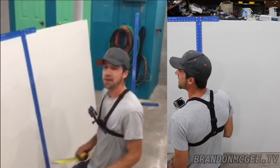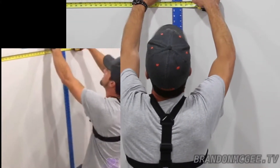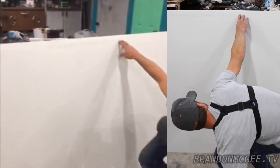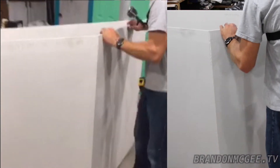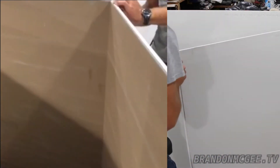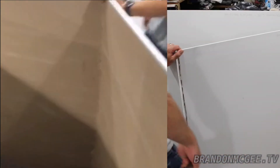If you've got a piece of drywall you're going to put on your ceiling, you'll first need to cut it. Our measurement is 56 and a quarter, so we just line up the T-square right there and use the utility knife to give you a straight line. It's always helpful to keep your foot on the opposite side of the way you're cutting. Apply light pressure on the way down — the whole goal is to score the paper so you can split the drywall easier. With just a small utility knife we scored it, then apply light pressure to the back to snap it, and then cut the paper on the other side.